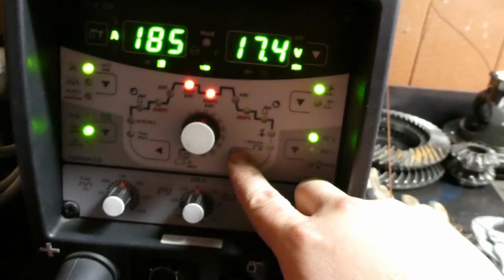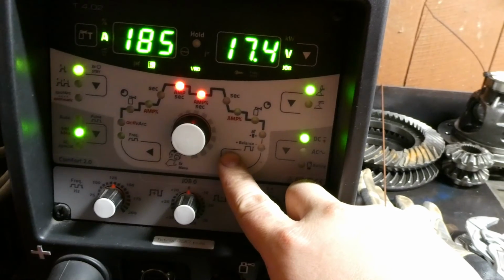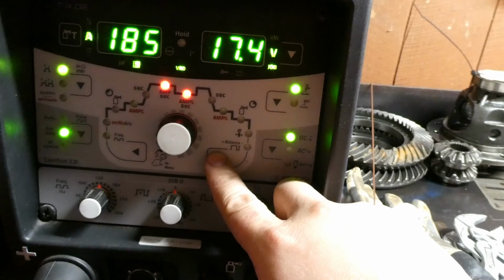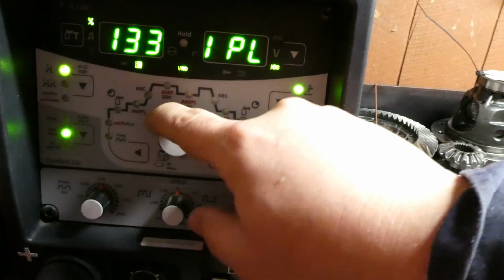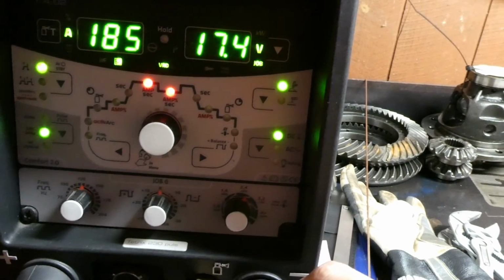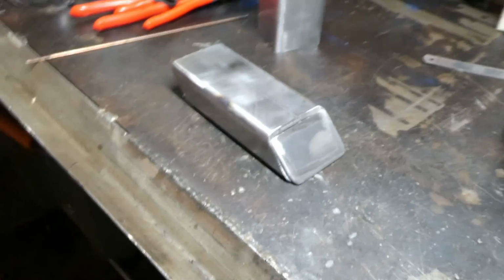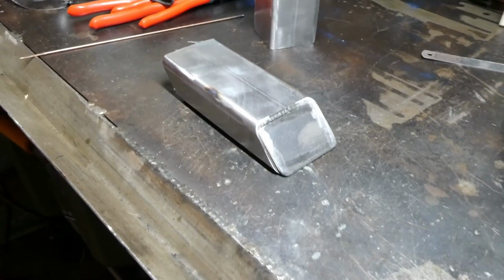And we're going to see a 33% peak, a bit of a blast of current with significant dwell time. So actually, just thinking about that, I might make it 40% peak, 40% above our target average on the pedal. So yeah, we'll give that a whirl, see how we go. We'll either work or it won't. And let's see it in action.